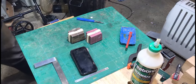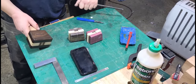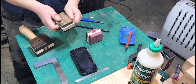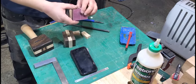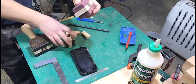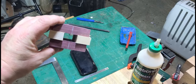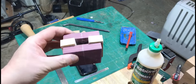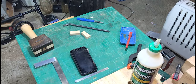It's now time to tap out the mortise spacers — nice and easy. Once they slide out, what's left behind is a perfectly tapered through-mortise which will accept the tenon on the handle brilliantly. As you can see, I'm using one of the mallets I made last year — yes, these mallets are very pretty, but they do get used. At this stage I could already feel that the head had a nice weight to it.